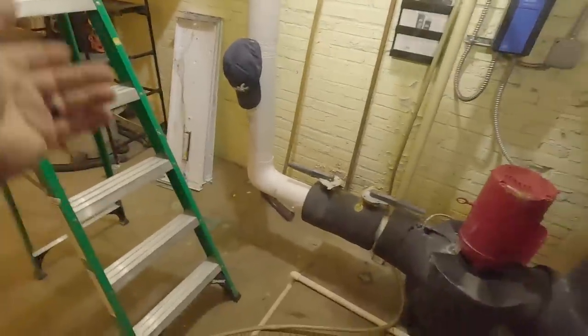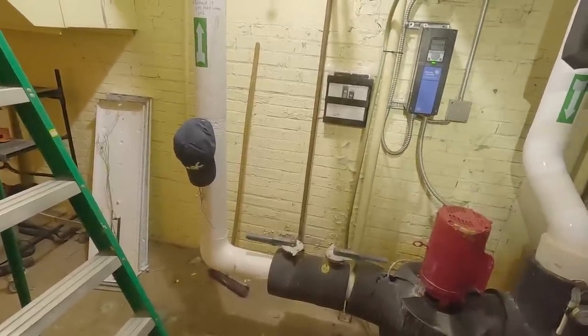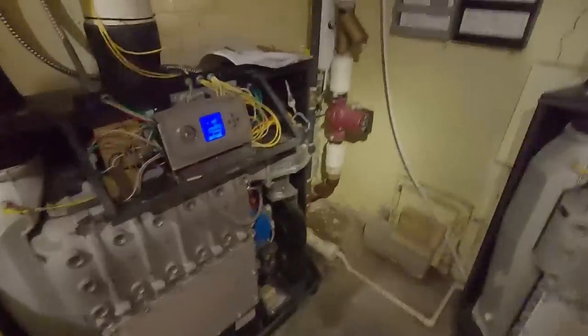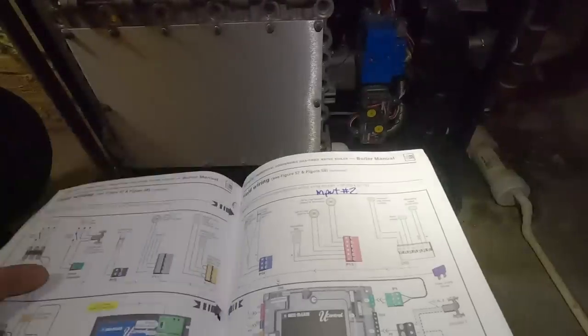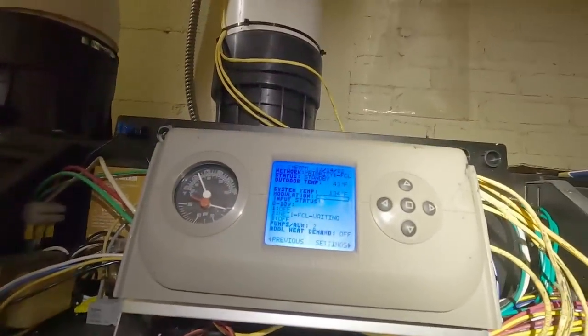I found out — it's the first time I've added glycol, so I was looking at burst factor versus freeze slush. I probably needed to add some water anyway because currently my burst is around negative 30, and we're never that cold. My slush was around 5 degrees — but if we should never slush, think about it: if these things are running and it's not a chiller, we're running a boiler, so we're never going to be at 5 degrees and worry about slush because we're going to be running hot water. My controls guy used to be an HVAC tech and he always has a good answer — he's the one who helped me figure out how to get this thing bled. He's doing everything I'm trying to do with new guys here and online: just trying to help and not discourage. Right now we're holding pretty good. We've got the outdoor sensor on there, trying to hold about 134 degrees. Everything's looking pretty good.